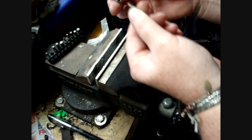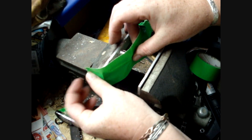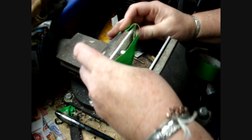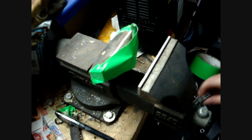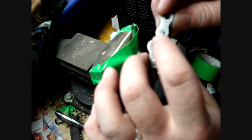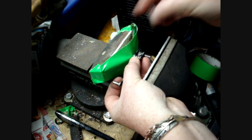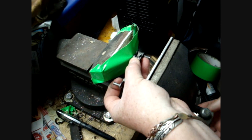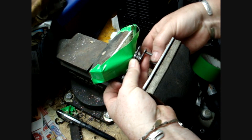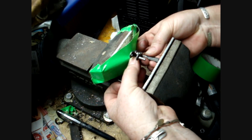This will press up against the pin. This will receive the pin as it's being pushed out. Put a piece of duct tape on the end here and fasten your socket into the vise — this is just to hold it, to cut down on the fumbling that would otherwise occur. Line it up with the hole on the socket and open up the vise enough to get in here — a little bit of a balancing act. Basic knowledge of curse words can be helpful at this point.